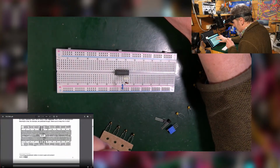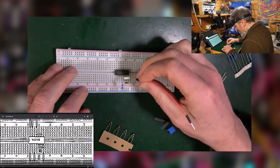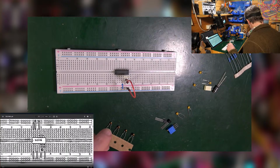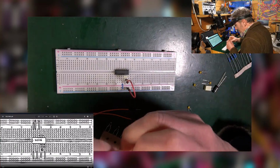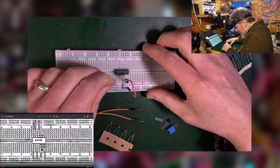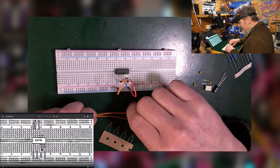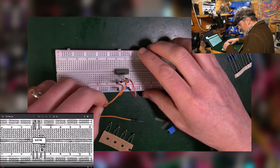So going back to our breadboard. I need to have ground, which is pin 7, attached again to what looks like positive. I need a bunch of these. I've then got to connect the inputs of the Schmitt triggers, it said. So pin 1, 2, 3. That also goes to ground, although it's not going direct. I've got it in the gap. That's annoying. It doesn't make any difference. It doesn't have to be completely straight because these and these are completely separate. So pin 1 also goes to there.